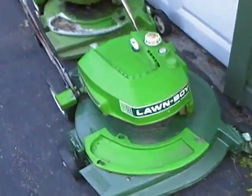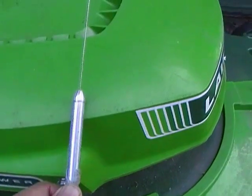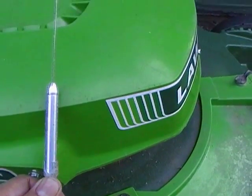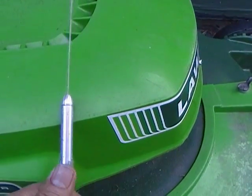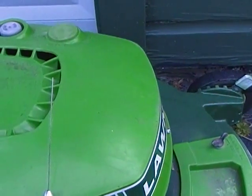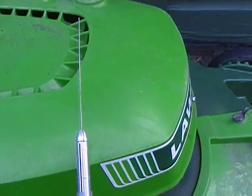How to use it is very simple. When the engine is not running, you basically just attach the tachometer against the engine. When the engine is running, the vibration will cause the wire to vibrate. You then adjust the sliding rule, and once you see the maximum vibrations on the wire, you read the rating. Hope the information helps.